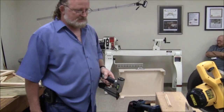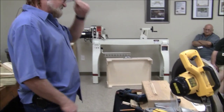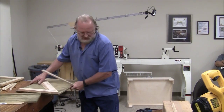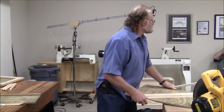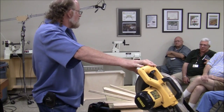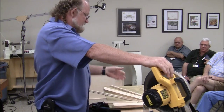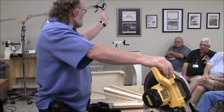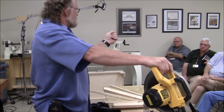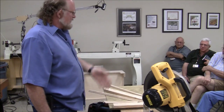I've had to replace a driver blade in it, probably because I was trying to do something stupid — trying to set a pin that didn't set by unloading the gun and holding it back over the pin, so I broke the driver blade. The thing with a pin nail — does it countersink? Yes, it countersinks right in there. If it didn't countersink, that would be worthless — I really don't want to pull a nail set out. What happens sometimes with any nail gun, if the grain goes strange, the nail will follow that. What's nice is the nail is so thin you can just wiggle it back and forth and it finally snaps pretty flush with the surface.